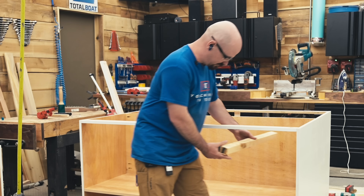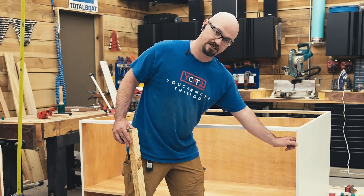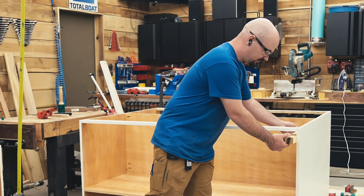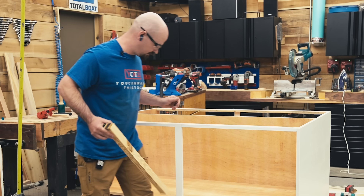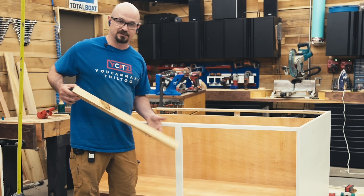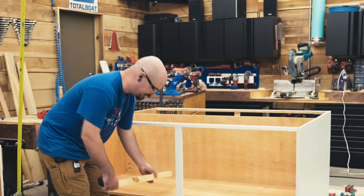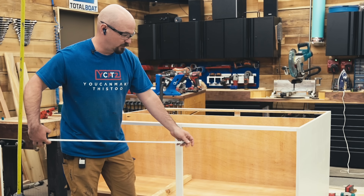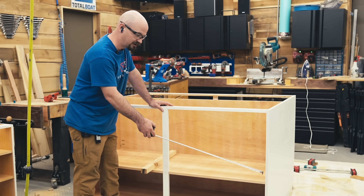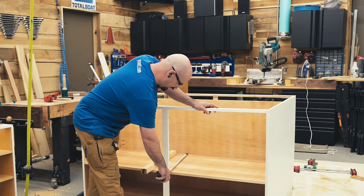I could mark it here, but the problem is the thickness of this piece. If I had scrap, I could hold that scrap flush — I'm pretty confident in my ability to feel flush — and then mark. But I don't have a piece of scrap, so this isn't going to be right. I need to do it here, but I'm worried about staying square to my back piece. One way I can eliminate that is to take my mark against the shelf here, because this is in a rabbet, so I know it's square to everything.